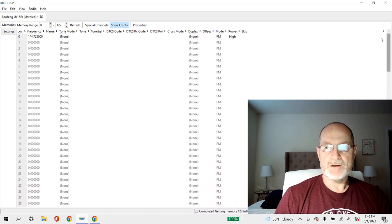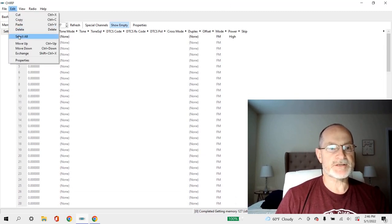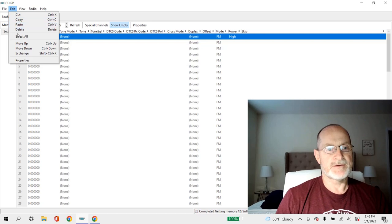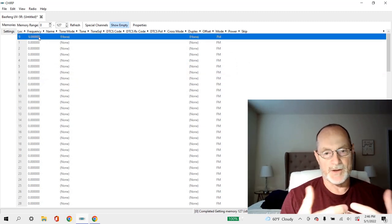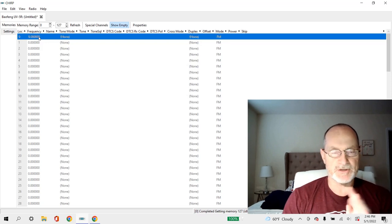So I'm just going to zero these all out. So I'm going to go edit, select. I'm going to select on the screen. Then I'm going to say edit, select all, which is going to select all my 128 frequency locations. I'm going to say edit, delete. So it basically zeroed everything out. So it's a blank template, if you will. Now the radio's still on.